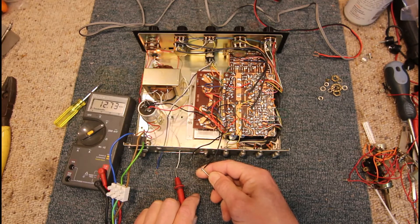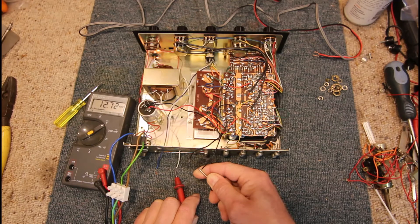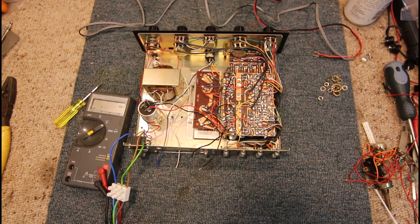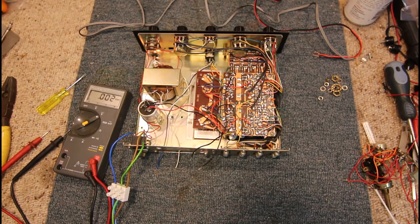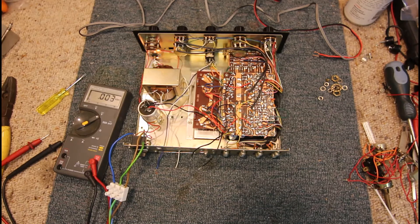Maybe they meant to have a voltage on them — it's just that one of them was disconnected before, because I think we had zero or close to zero volts on one and voltage on the other. So I might have to put a dummy load on these rather than risking a set of speakers. You can put a fuse inline with your speakers — just half an amp or something — and then it'll probably blow that before burning out the speaker coil. But I've got a couple of big 100 watt dummy loads, so I might hook those up to one channel and see if that drops the voltage. That's a much safer way to do it.